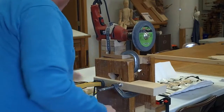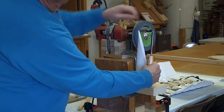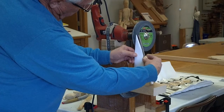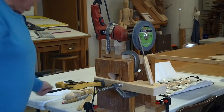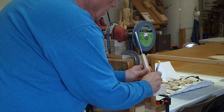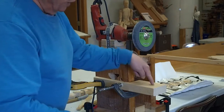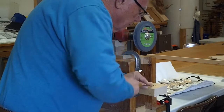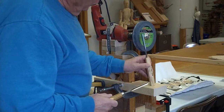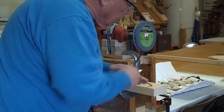I've got the pedestal now and I can put this against here. I lay this against the wheel and set my angle on the tool — I just eyeball it. I'll get a pencil and mark where that hole is going to be, then carve a hole into that piece of wood. I'm carving the pocket in here in the wood — it doesn't have to be fancy, just the hole. You want the tool to be able to spin on it but not come out of the pocket.